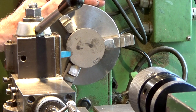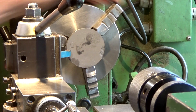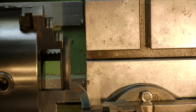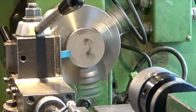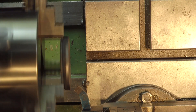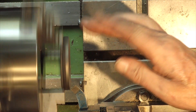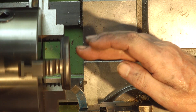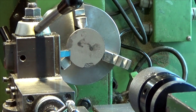The first part of the operation: we've got the wheel in the chuck. Because these castings are quite good, it fits nicely in a three-jaw chuck and spins pretty well — it's not really running out at all, running pretty good. I've also got the machine on its slower speed. Cast iron is a very dirty metal; you get a lot of dust from it. The idea is just to get a nice smooth face on there — that's the first thing we're going to do.